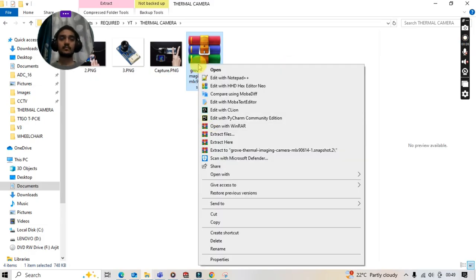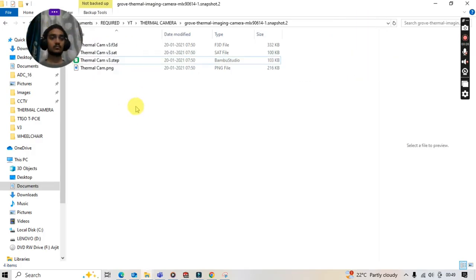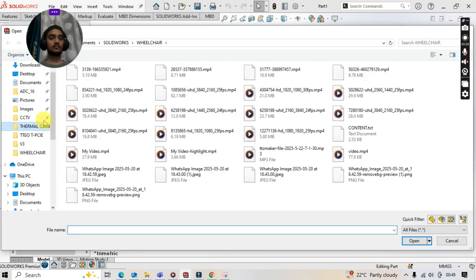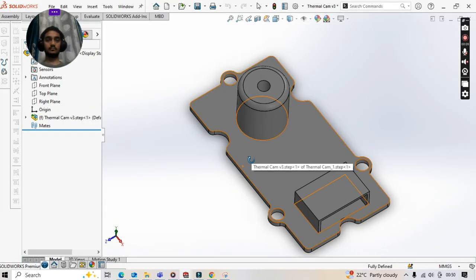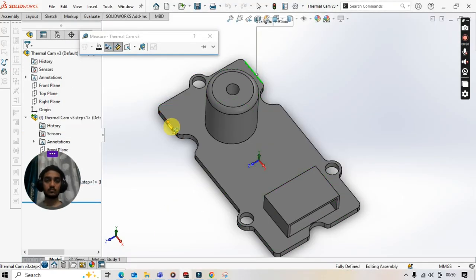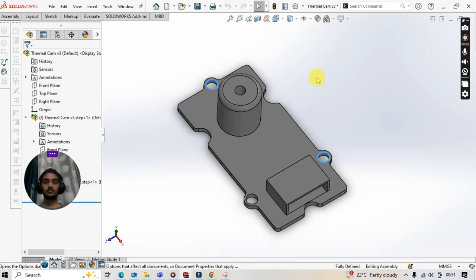Once you have the zip file, open it in SolidWorks. Open the step file using SolidWorks. You'll now be able to rotate, view, and analyze the sensor in 3D. Once you gather those values, go ahead and make cutouts in your sketch where the holes need to be. Use extrude cut for the holes. Create boss features, raised parts, to secure the top cover.